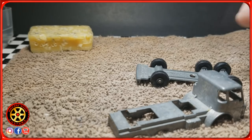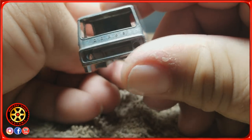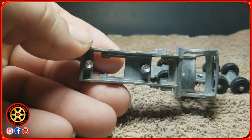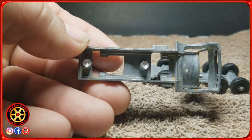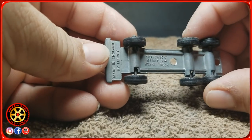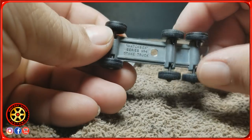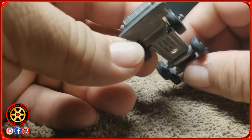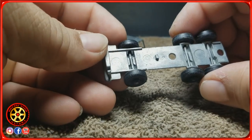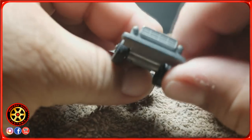Well guys, here is the casting without paint. If you notice, I have not drilled the post completely and tapped it. We're gonna do that pretty soon. Here is the base. It did have a little bit of paint in this area. I removed it with a Q-tip and acetone. Came out rather quickly. I might polish this, especially here at the front. Get a really shiny surface here.